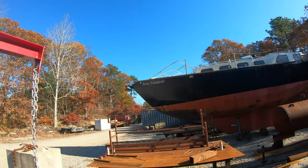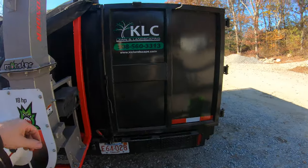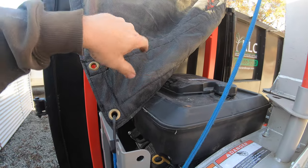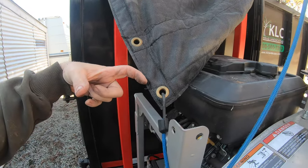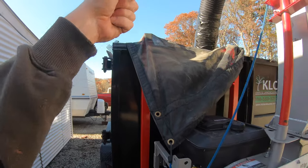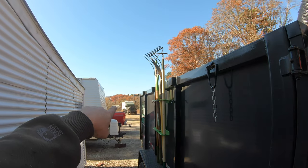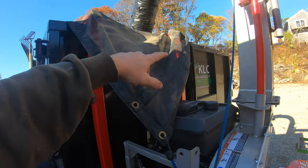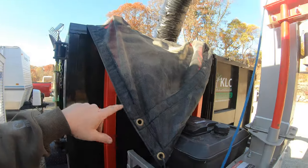It's not time yet for full final cleanups, but I want to do a couple to start testing the equipment and make sure everything's good to go. The tarp also has a pocket sewn into it where you can put a metal bar through, extending past the tarp. You add big washers with a spacer as rollers on each side, and when you pull it the rollers ride across the top of the sides to tarp it. Then hooking mechanisms come around and hook in, and you tighten it with a ratchet in front. I haven't even used the tarp since I got the trailer — it's a nice, heavy-duty mesh tarp, perfect for this leaf loader.